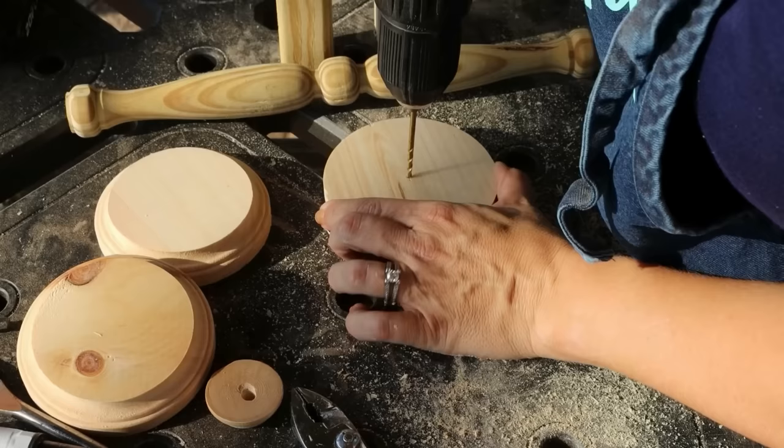We're building the chandelier frame — I didn't want any exposed nails at the joints, so we insert dowels inside. Take one of the long pieces, put a nail in about the center, tap it in, make sure it's level, clip off the nail head with wire clippers so it's sharp, line it up, tap with a hammer to make a mark where the starting hole should be, remove the nail, and drill straight down. Do the same to the other piece.